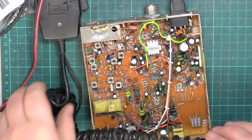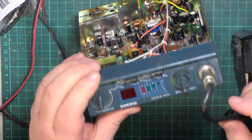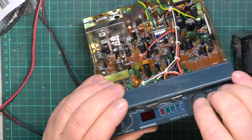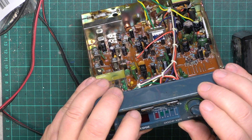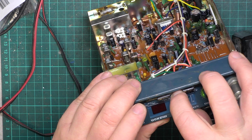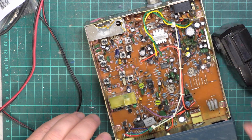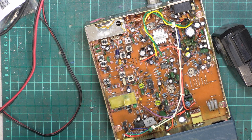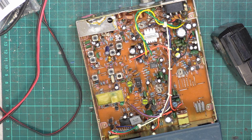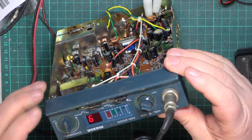Okay, so we've got power on it, but we've only got 2 wires, as you know. So whether or not it will power up, I don't know. Let's see what happens. No, I'm not sure it's going to. I think we'll have to put a jumper across for now, because we haven't got the right power lead for this. You need a 3-conductor one. Okay, so I've jumpered that, as you can see, and we've now got it coming on channel 9, which it probably does.